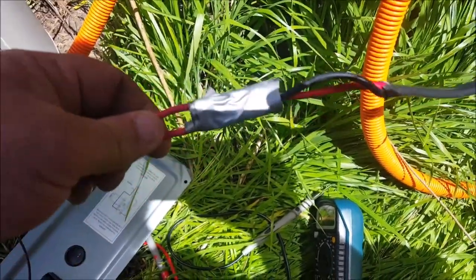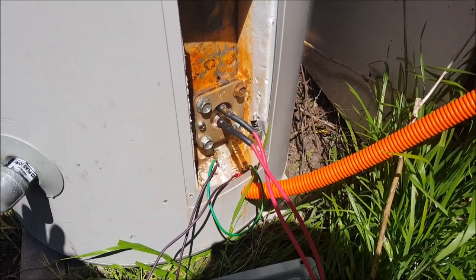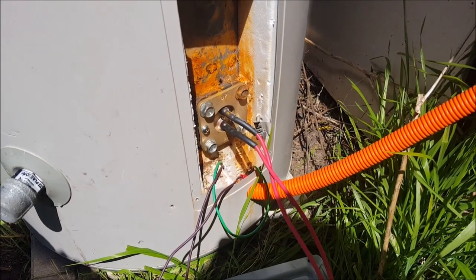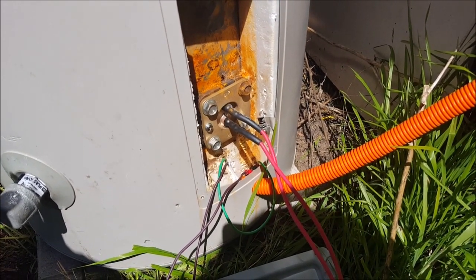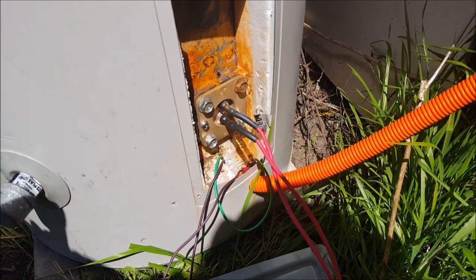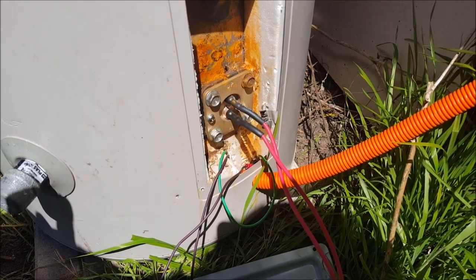Alright, so I've got it wired up. I will get some heat shrink to cover these connections, but for now a bit of tape's going to do. One thing I didn't mention earlier about heating elements — they're a resistive element. It does not matter if it's AC or DC going through it, it gives off heat. What is important — and I'll have another video to explain that once I get my meter back — is to have the resistance of the element matched to your power supply coming in.